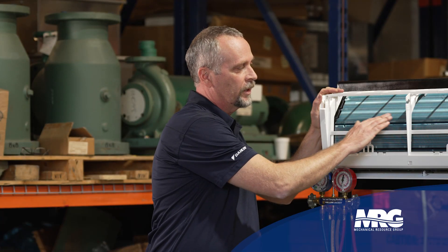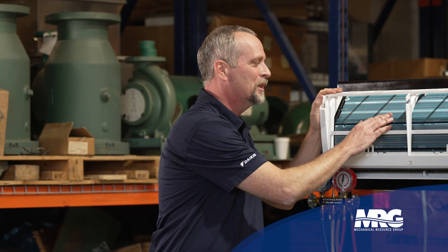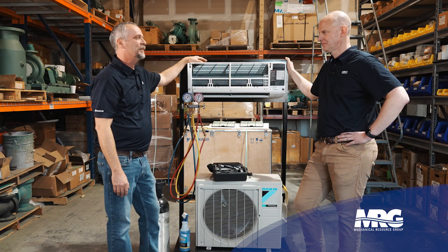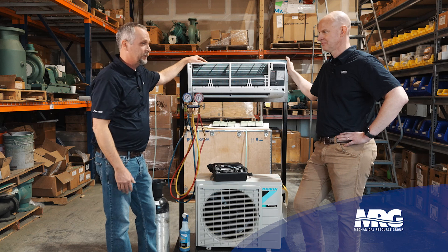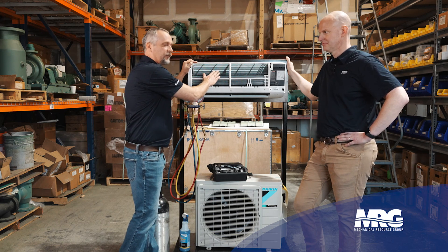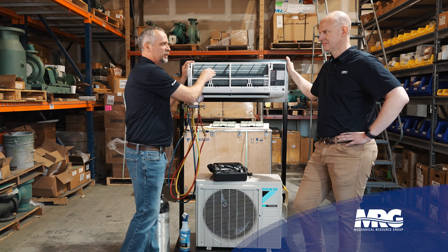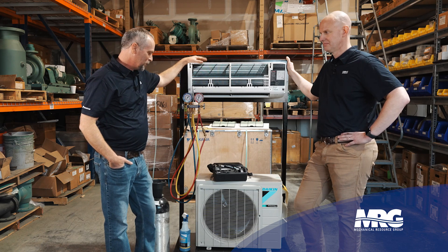If I were to pick one up, there are copper tubes running under these fins. I take my screwdriver and slowly start spreading these fins out. It still makes a mess and it's tough, but you can do it — you're going to make a mess of that coil pretty much. So if the leak is in the coil, unless they just have to have it up and running, a lot of times it's better to change that coil out. Sometimes it's obsolete with long shipping delays and the customer needs it up and running. You have to spread this out, expose that copper, use your spray bottle, find exactly where it's leaking. Spread it out a little further because after you pull your gas and you've got your torches on it, you don't want to melt this aluminum. Let your customer know what you're about to do before you chop a big hole in the coil — but it can all be fixed.